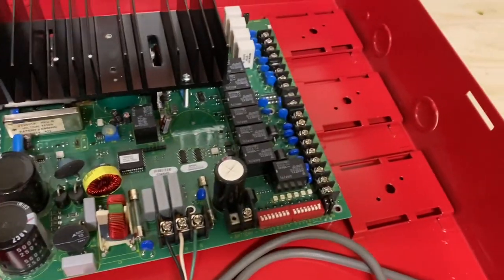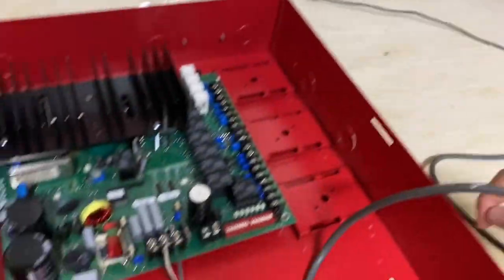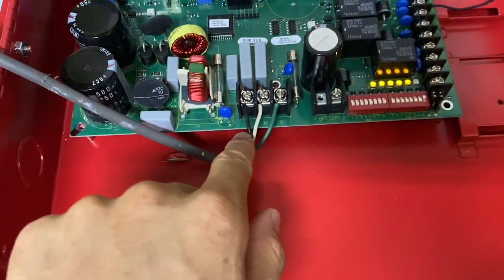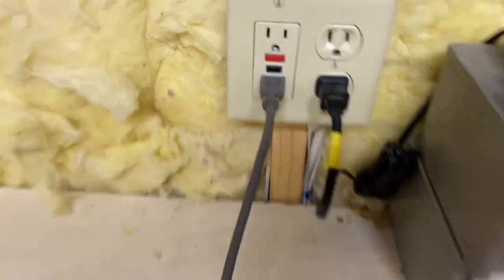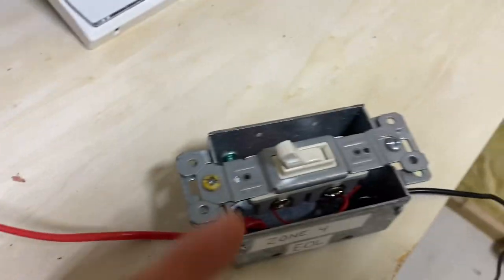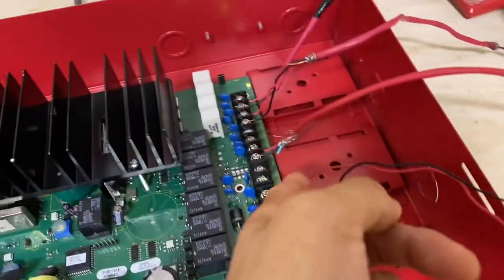I'm not going to connect this to a panel right now or my building's electrical system. So what I did is I hooked this up to a regular three-prong cord. I've gone ahead and wired it up very simply. For mains power, this is usually going to wire into your building's electrical — it's powered by 120 volts. I just wired that to a cord plugged into a wall outlet. For my fire panel trigger, I hooked up a 24-volt transformer on a switch, so when I flip this switch it will simulate a panel going into alarm and sending 24 volts through the trigger.